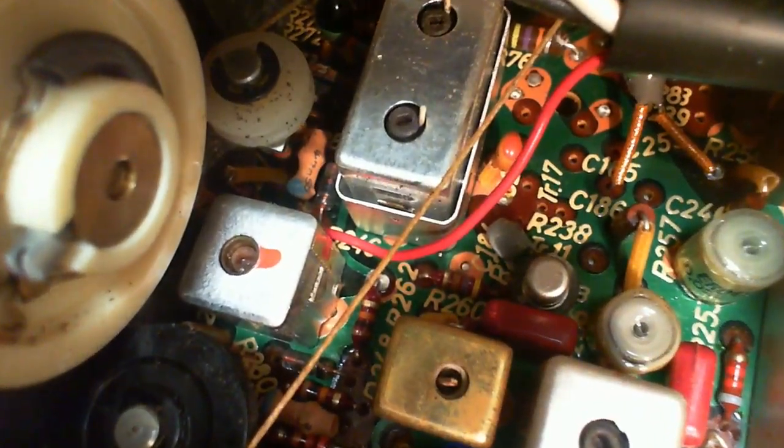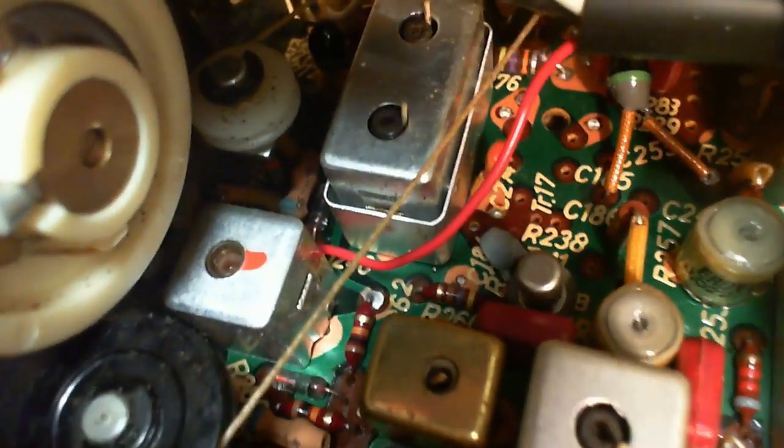Now, is there any hint on the board? Is there anywhere where they say, Jim, this is the one? Just all the component value numbers rather. So in an FM tuner, in the area where the detection's occurring, there's usually some symmetry in the components. It may be a long shot. Can I spot something that looks symmetrical? Yeah, I don't think so. There's also an electrolytic capacitor that's critical, usually in the FM detector. Good luck spotting that. Holy smokes.